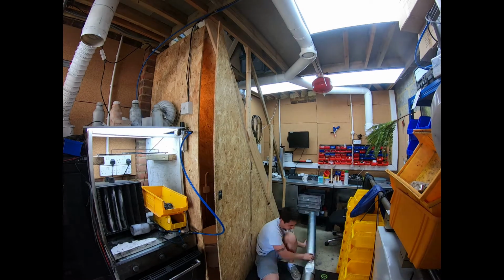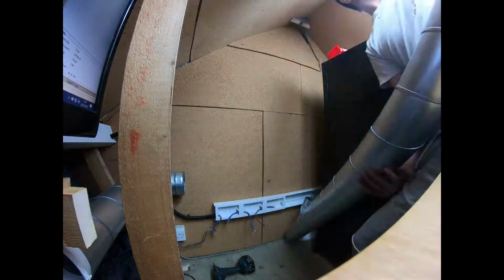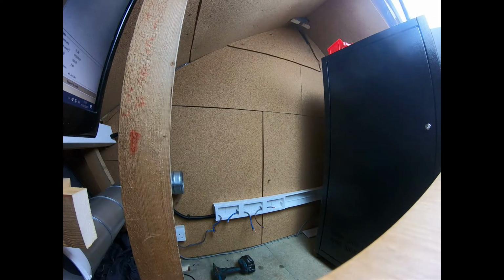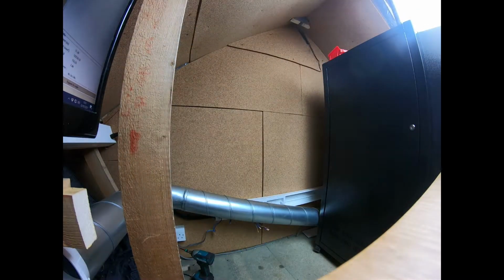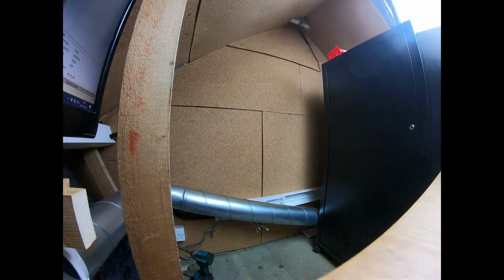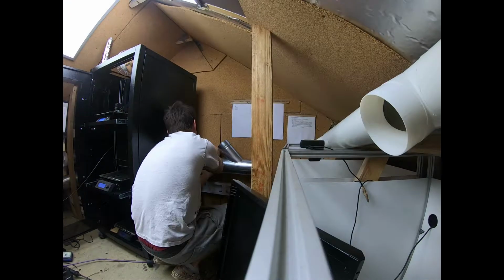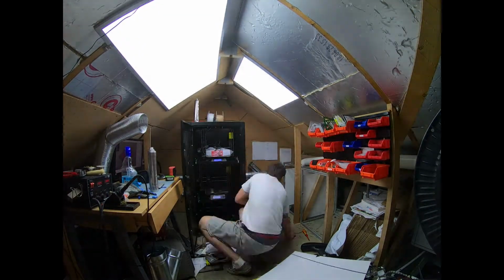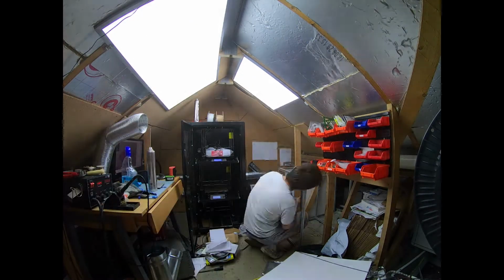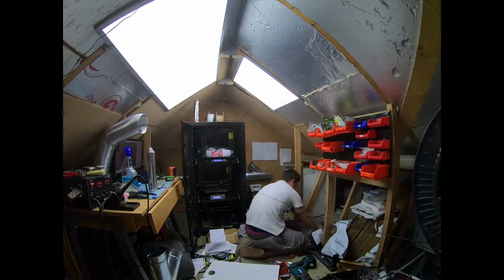I'm going to use nice sweeping bends, so that'll get cut. We'll carry on with a bit of rigid, is it aluminium or steel? I'm not sure, I'll just call it aluminium for now. Aluminium duct. No, it's steel actually, I'm pretty sure it's steel. Okay, we'll go steel. So we carry on with a steel duct into the corner, sweeping bend, or two Y pieces with a 45 degree cut like this. One's got a 100mm adapter coming into it, which is just over the back there, and one's 125mm.